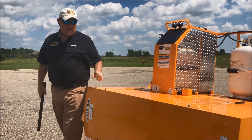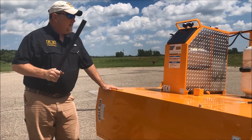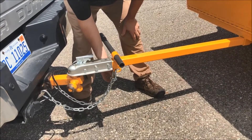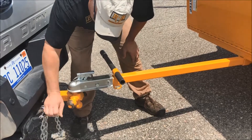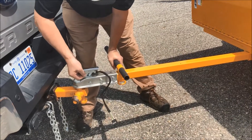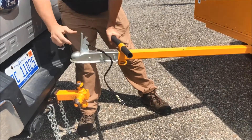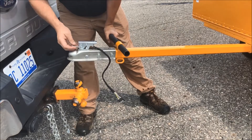Hello folks, today we're going to show you how to fold and unfold the KM 440 or 448. These handles work out well to help aid in unhooking it. It comes with the safety chains — you want the chains to stay connected to the vehicle. Very important: once you lift this pin up, put the latch back down. You do not want to leave the latch in the up position or it might damage your unit. As soon as you unhook it, put it back into this position.